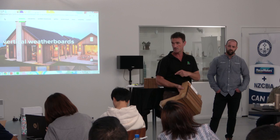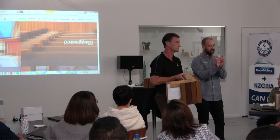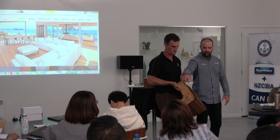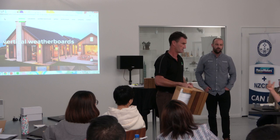The other thing to think about is you may see some specifications with 18mm thick weatherboard and 28mm thick weatherboard. And you can get variation for different looks and different styles. And as Hamish will probably back up, the nail has to enter through the cavity into the building, 30mm into the timber. Into the frame, yes. So 30mm penetration into the frame.